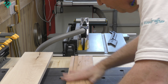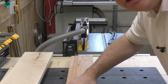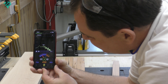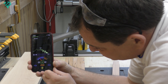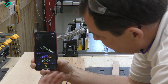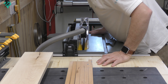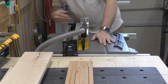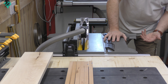That was super easy — the cherry is all ripped and it's all come out exactly the same size, which is what you want. Holding them together you can see it's made a really nice cut. The decibel reading came out at an average of 75.8 decibels, peaking at 93.2. That was slightly better than before. And the dust collection is much better — not seeing any dust on the bench at all, a small amount on the side, but overall better than expected.